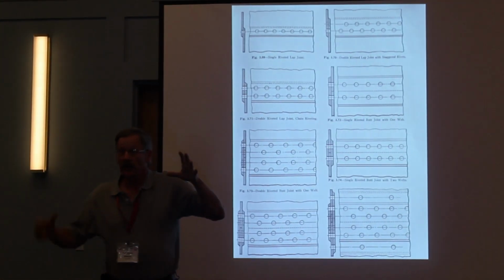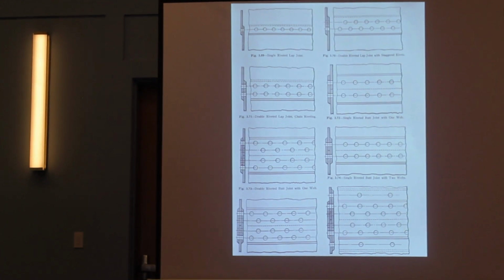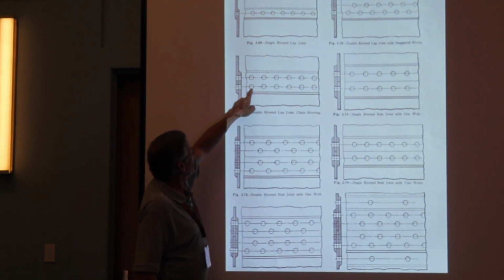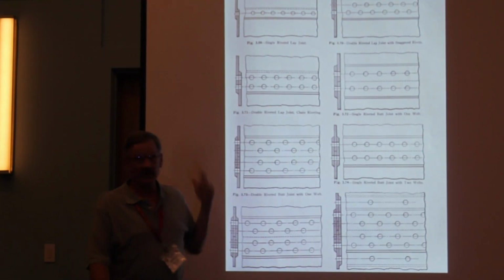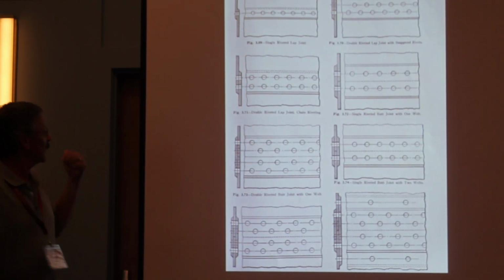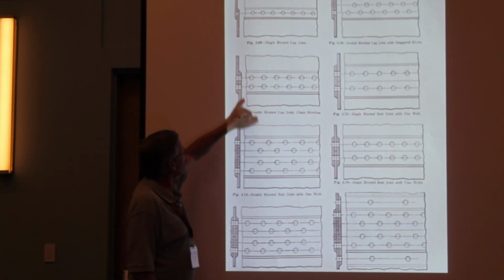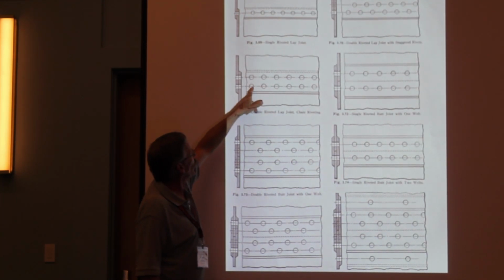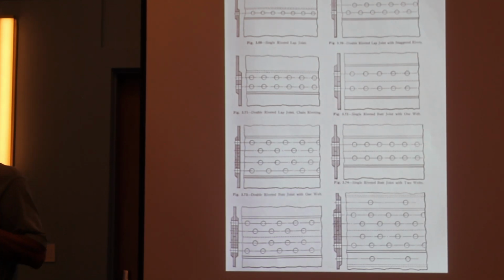So a very simple way to put this is, if you have a 4-inch pitch, I'm not using a pointer, I'm just using this. A pitch is from center to center of each hole. So let's just say that's 4 inches. You put rivet holes in there that, just for discussion purposes, are 1-inch diameter. So basically you go from here to here, so you have 1/2 and 1/2, that equals 1 rivet hole. So if it's 1-inch rivets, you have a 4-inch pitch.